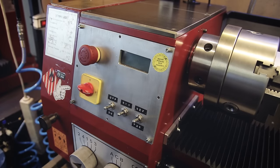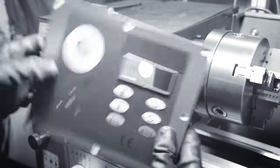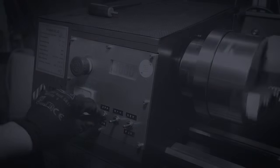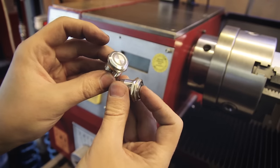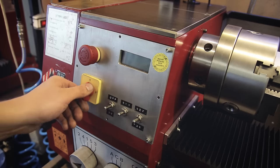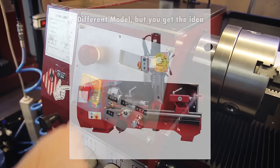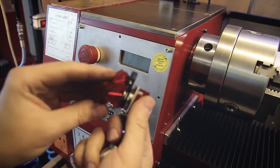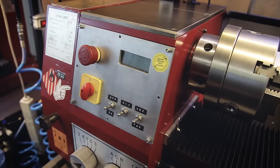The next one is technically another redo of a previous improvement. In the last lathe video I briefly talked about how I exchanged the original control panel for this lathe and installed new switches because I didn't like the controls it had before. This was definitely an improvement but after using it for some time I still wasn't 100% happy with it. While the up-down switches make sense for the speed and direction control, having a single up and down switch to start and stop the spindle always felt a bit unintuitive to me. So I want to change up the panel once more and install these dedicated buttons for the spindle control. One more thing I want to change is the main power switch - this actually is a two-way switch with two on positions and one off position, for a milling attachment that I've never actually seen for sale anywhere. Since I want to install more buttons I need to free up some space on this panel anyway, so I want to replace that with this switch here because it's not as big, it fits with the other switches, it makes more sense, and it looks like it came out of an airplane which is awesome.